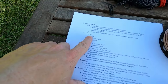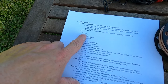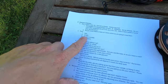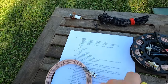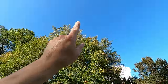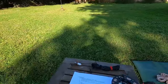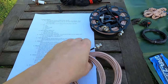Is it better to carry better quality coax in the field? Probably — it's definitely going to be better coax. But you've got to consider the fact that if you're dragging it out in the woods, it may get damaged. Depending on what frequencies you're running and how much power you're running, you may have to change different sizes. Length is kind of dependent on what you're doing — if I'm putting up a dipole, I need longer coax because I want to get that antenna way up in the air, about 30 to 35 feet.